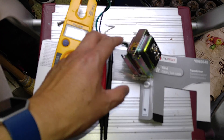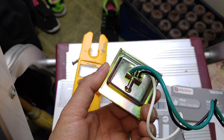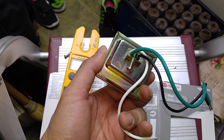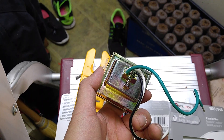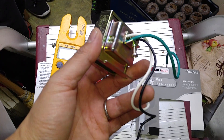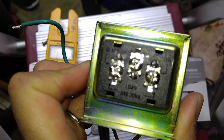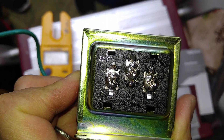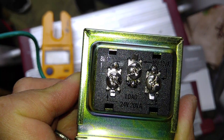This is a transformer — this is what a transformer looks like right here. It's basically a coil; this is called a step-down transformer. On this side, these wires are the input from your household electricity: your typical white wire, black, and then green for ground. It's simply matching up the black and white wire to your current household wiring. On the back, this particular one I picked up from Lowe's — you'll see on the left side it says 8 volts, pointing to the left and middle terminals.